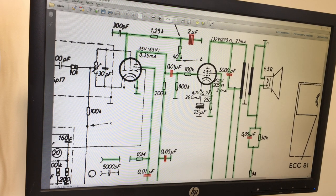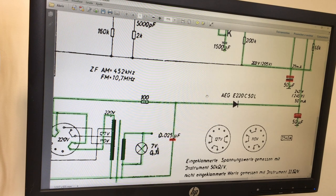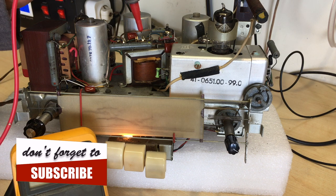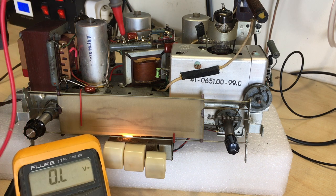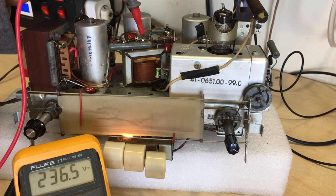The speaker is also connected to ground, but that's inside — there's no external speaker socket, so that's not a danger. The main difference I noticed in measuring voltages was when I replaced these capacitors. I've got the radio on with the limiter bypassed, at 227 volts going in, drawing 120 milliamps. At the output transformer, I'm getting 236 volts. On AM that goes to 241. The second B plus is 213, supposed to be 205, which is fine. In another case it's reading 197, supposed to be 202. That is all beautiful — in this kind of setup, three to five volts either way means absolutely nothing.